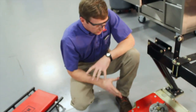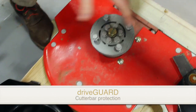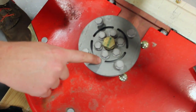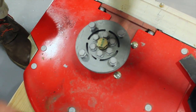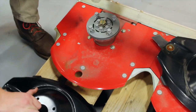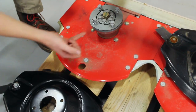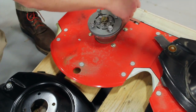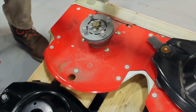Before we assemble this, let's talk about the drive guard protection in this cutter bar. This is our drive guard disc. At several points on the cutter bar, we have shear protection. If the end of this cutter bar were to hit a solid object and stop this cutter module from turning, it would actually shear this disc at that point. This module mounts on the bottom side here; it rides up underneath, and if it stops, this disc shears and protects the rest of the cutter bar.